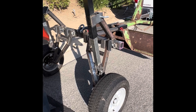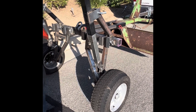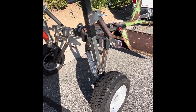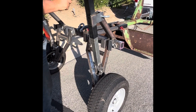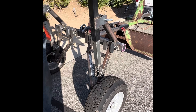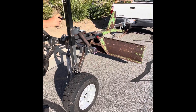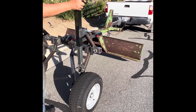We've got two more inches. It's pretty much straight down now. We nailed it. You want to change the pitch from one side — you can lower one side and it causes the blade to drop right down and make a point against the ground, so you can create crown.